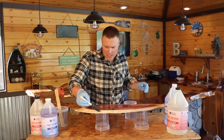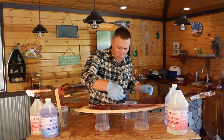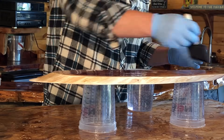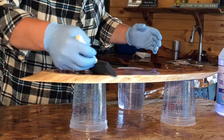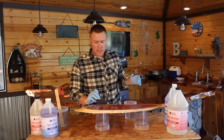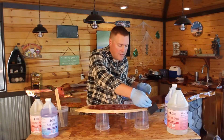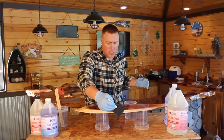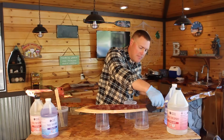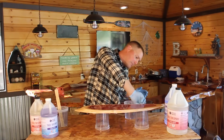Some parts of the project take more epoxy than others — that's based on how porous that wood is. After you've got an even coat across, you'll notice I haven't really spent much time on the sides, and that's fine, because this is not the final coat — this is just a seal coat. We're trying to do this to prevent bubbles. This is really important: the seal coat allows any air to escape to the top side.